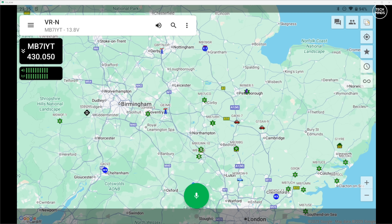As mentioned earlier, Bluetooth connectivity provides both data and audio. If you have the audio option enabled, you can listen to the radio through your device's speaker and press the PTT button on screen to talk into your Android device, with your voice then transmitted over the N7600 - essentially turning your device into a speaker-microphone.